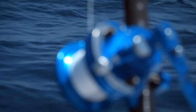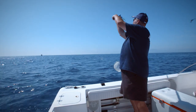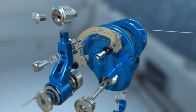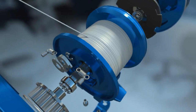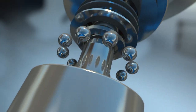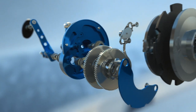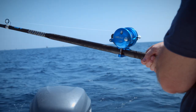When you're fishing for big game, your reel is your best friend. It may look simple, but it's packed with technology that helps you cast long distances and even tires out your fish. A super light aluminum alloy frame houses 141 precision-built components. A spool loaded with over 500 meters of specially braided line can take the weight of 30 kilos. Inside, stainless steel ball bearings spin the reel over 10,000 times a minute. Precision gears crank up the speed and turning power of the reel. It's a miniature metal masterpiece, but it's also got to be tough enough to withstand the pull of big fish.